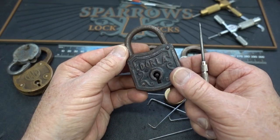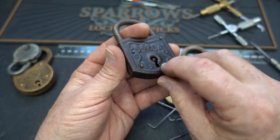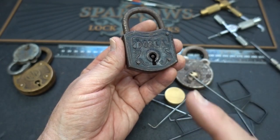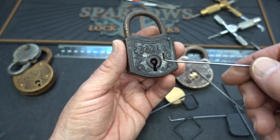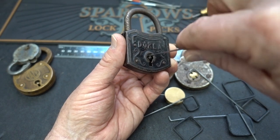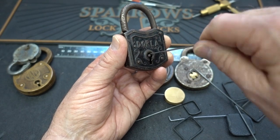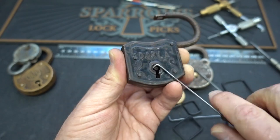Let's check out this little door lock. Now this one's real cheap, and again you're going to make a quick decision: cheap metal, wide open keyway. You can look inside of there and see there's really, underneath this thin layer of tin, not a lot in there. You're going to have a lot of room to work around. So grab probably one of your longer pieces of wire, and we're going to start just like it's the key. There's nothing on the left — something there on the top though. And there you go — two levers, nothing to it.